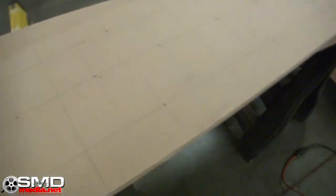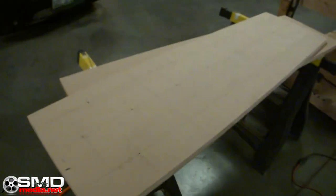So when I take this top lid off, look at what I'm left with — a bunch of holes. Don't even have one single pencil mark on this bottom sheet and it'll be duplicated just like that. So anytime you want to make a speaker box and do a double baffle on the top or maybe a countersunk woofer, put both your pieces together and do one pilot hole through the top and bottom and there's no way it can't be centered. Just a little tip for you.